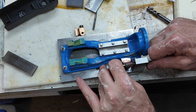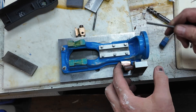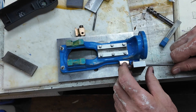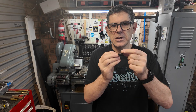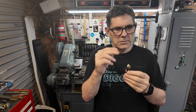I've bolted the guide on the side there with the bolts, tightened them up, and we are pretty good - I can push that through. It's a little bit stiff, a tiny bit of binding, but that's pretty close. So that's the story of the valve guide. The insight of the little fixture to hold this and the alignment fixture on the fixture plate - those techniques worked really well.